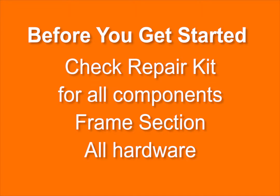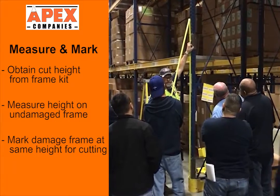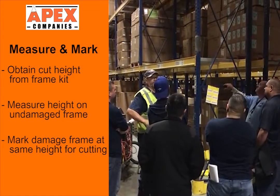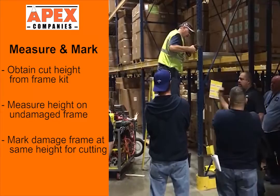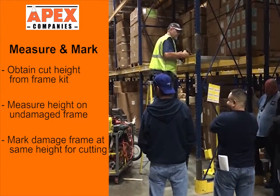Check to make sure that you have all necessary tools to complete the installation at the repair location. Also confirm that you have the correct repair kit and position the hardware needed so that it is easily accessible. The cut height of the damaged frame should be obtained from the repair kit and transferred to the undamaged frame of the exact type. Once this is done, the damaged frame can be marked for cutting. Remember, never measure up from the floor directly to the damaged post.